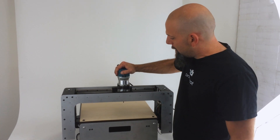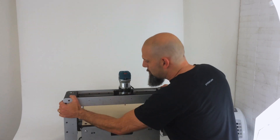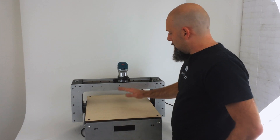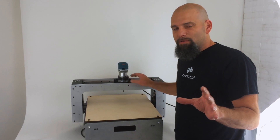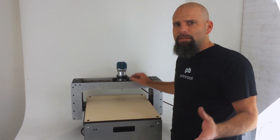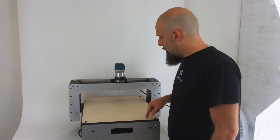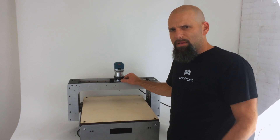As far as rigidity, I'm telling you that this thing is so rigid — you can't move it without moving the table it's sitting on. This is about 4 to 4.5 inches of Z travel. This particular model is 14 by 14 inches, both X and Y, and about 4 inches on the Z.